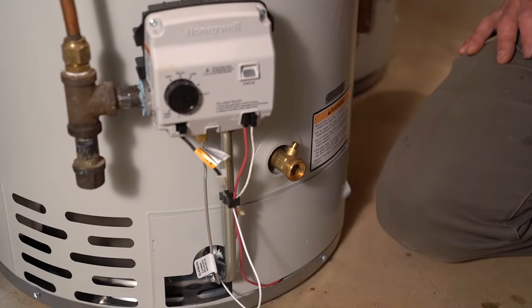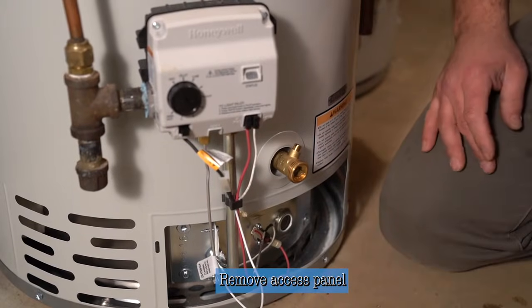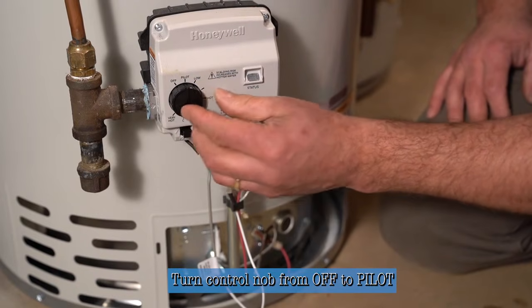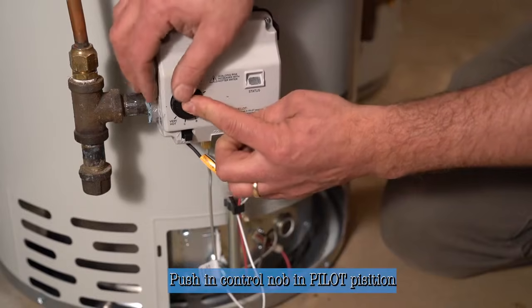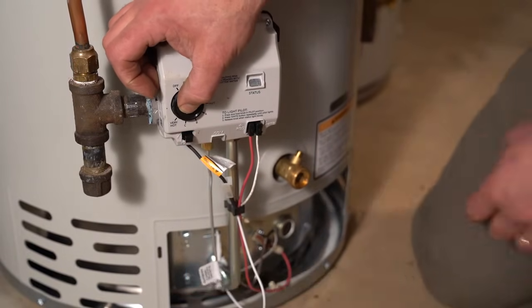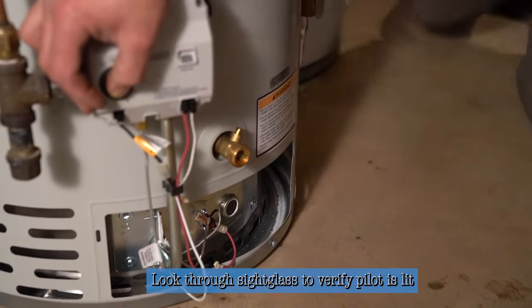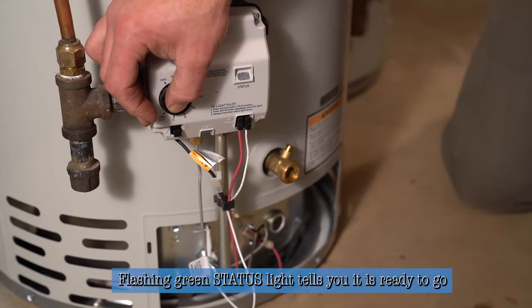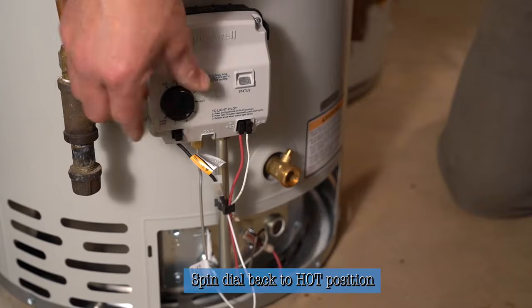What's left is to turn the gas back onto the unit. We'll remove the access panel. There's a sight glass here so we can see exactly when it's lit. We're going to take the control knob from off to pilot — it's the only position where the knob will push in; anywhere else on the dial it won't depress. At the pilot position it'll push in, releasing gas to the pilot. Click that two or three times. You can put your face to the sight glass to confirm the pilot is running. I can see a nice blue flame in there, so the pilot's ready to go. Within 20 seconds you'll hear an audible click, and then a green light will start flashing at the LED, telling us it's ready to go.